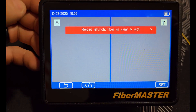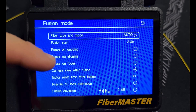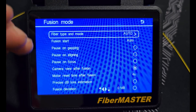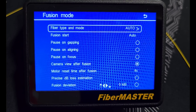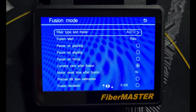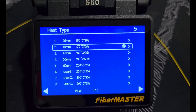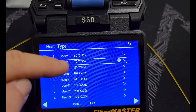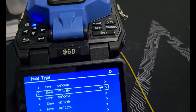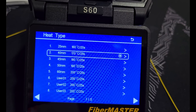There are a bunch of options on the machine. In fusion splice mode you can adjust all your settings — it's set to auto, and you can set pause on gapping, aligning, or focus so you can inspect before proceeding. Right now it's set so closing the door automatically starts the splice. The heater is about 25 seconds for the 60 mil tubes. I actually had it set to the 40 mil profile by mistake, but it still shrunk pretty well — just always make sure your settings are correct before splicing.